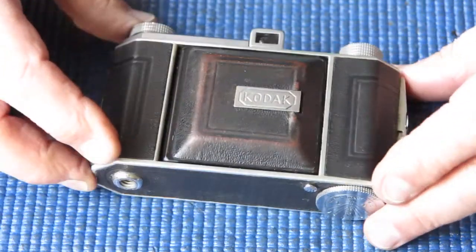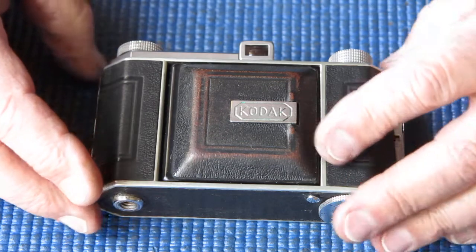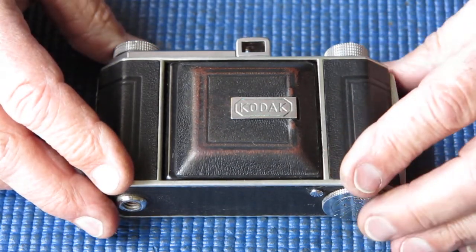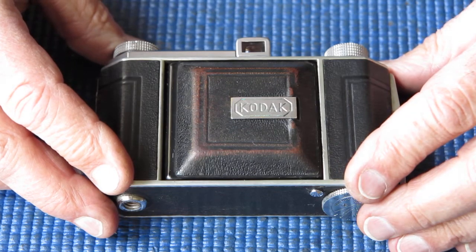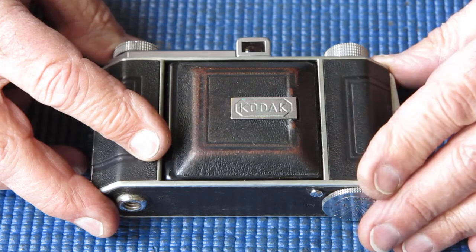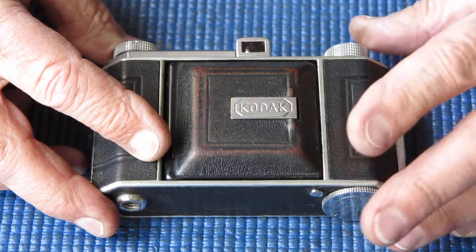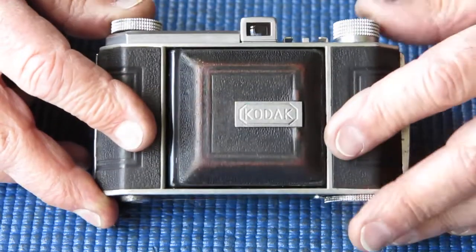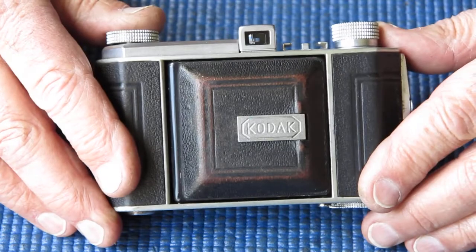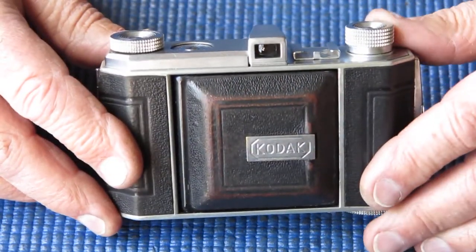I wasn't expecting to see this camera back again. This is one I repaired some time ago, and if I recall correctly, at the time it was obvious the bellows had been re-glued previously by someone else. Checking the glue, those bellows were very firmly attached, and I did nothing to the bellows apart from paint some black paint around the exposed edges of the metal to stop reflected light causing flare.